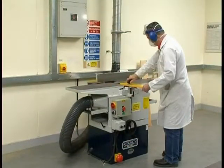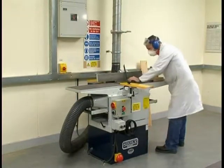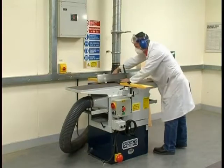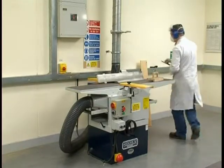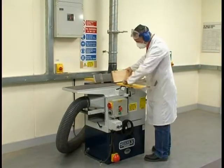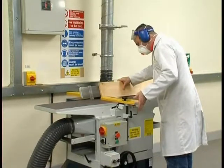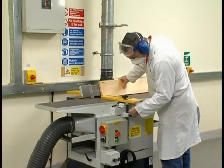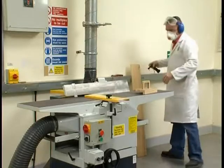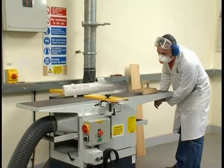Beveling can be achieved by adjusting the fence to the required angle using the lateral cant lock. The angle required is set using a sliding bevel or a protractor. The bridge guard is set at 8mm from the workpiece. Adjust the height of the infeed table and set using the table guide. It is recommended that no more than 2mm be removed per cut.